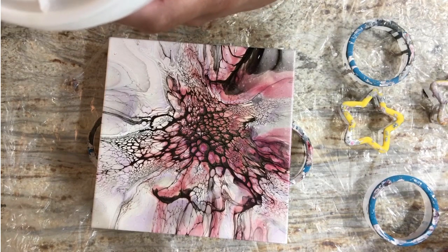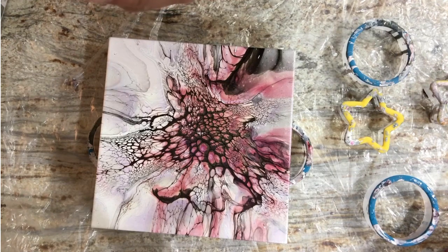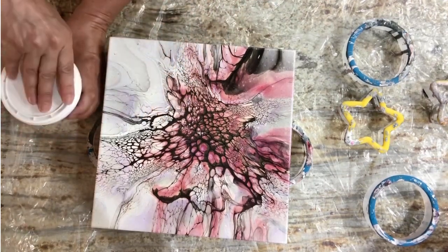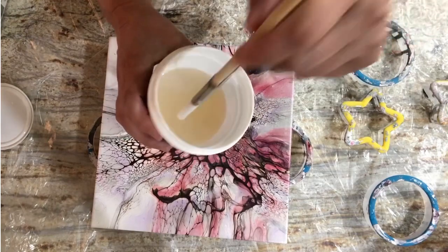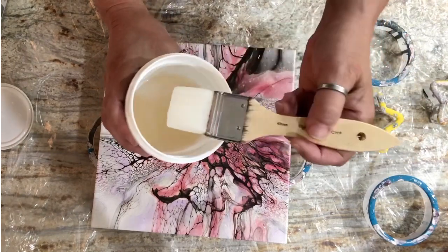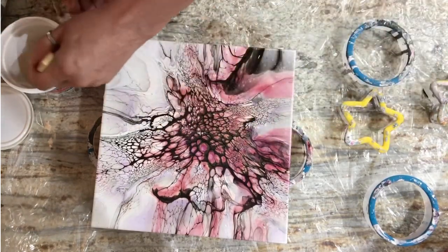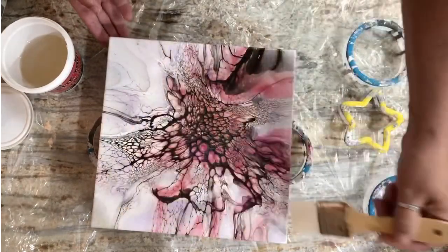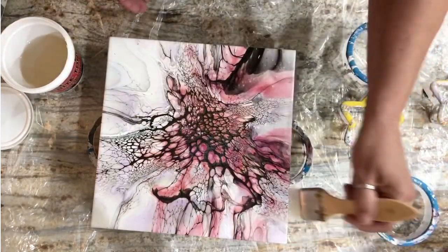Just taking a quick look at the back of this — it also has UV stabilizers that'll keep your dyes, stains, and paint brilliant and protect the colors. It dries crystal clear. Low odor, low VOC, non-yellowing. This is what it looks like on the inside — it's fairly watery. I'm just going to give that a little stir. This is just a little paintbrush I got at the dollar store, and I'm just going to do this pretty quickly, give it a quick brush. I want to check it for coverage, make sure I didn't miss a spot, then do my sides.